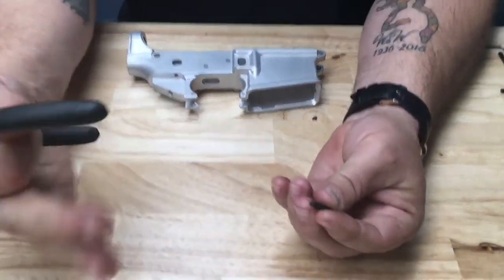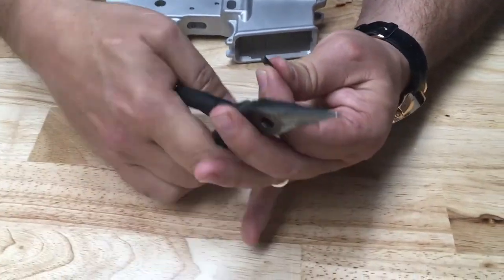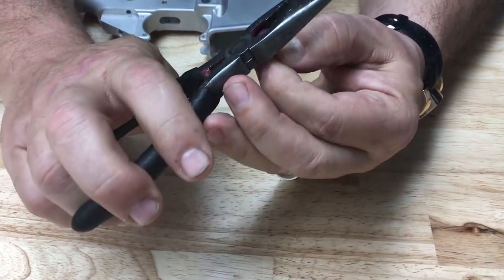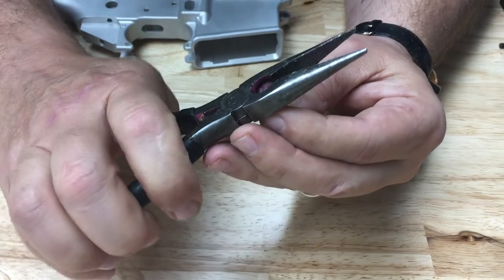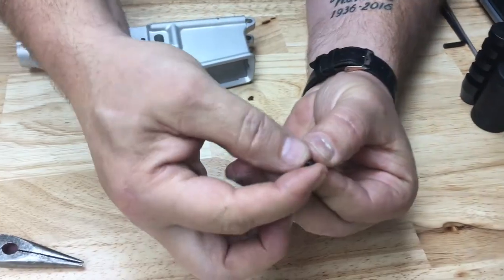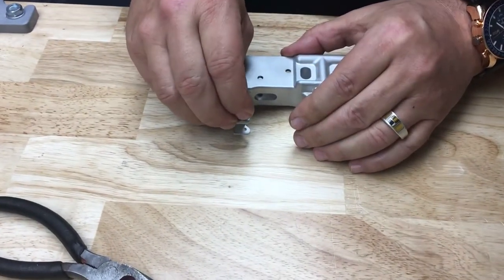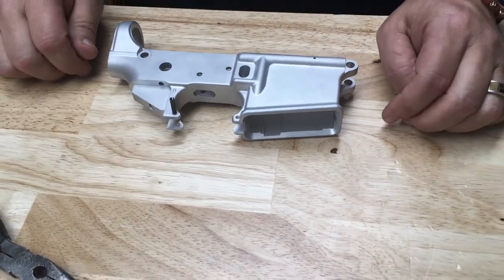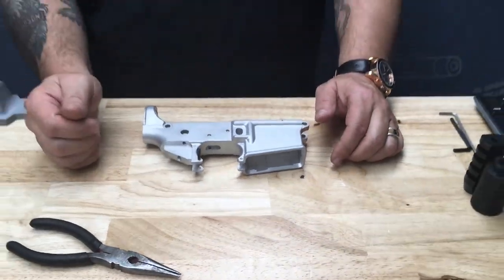So what I do is I take a pair of needle nose pliers that have the wire cutter here, and I'll smash the end of the pin closed, thereby shrinking the diameter of the pin. Then it allows that pin to sit in the hole. It doesn't go in very far but it goes in just far enough that the pin is going to stay in place, then allows you to use a punch or whatever it is you might have to guide that pin in with a hammer and not have to try to hold the pin at the same time.